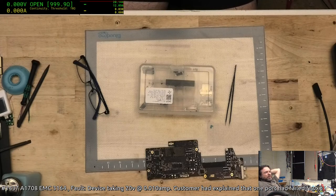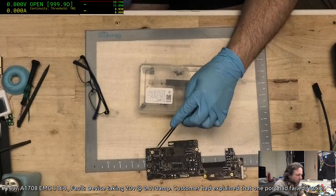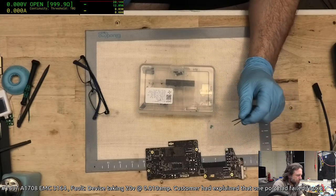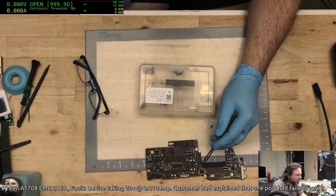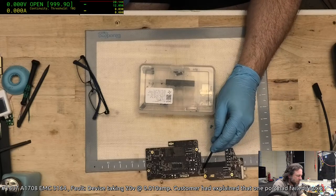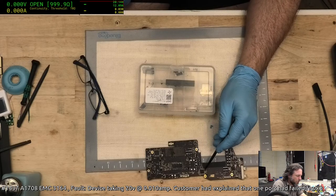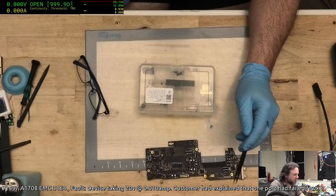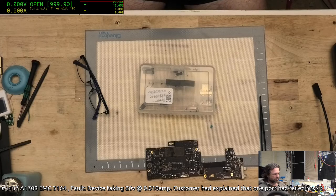Yeah, I've just got to think why we wouldn't be getting those elevated states. You know, SMC is a possible candidate, and it's a lesser complication to replace the SMC than it is to replace this banjo chip. I think it's a banjo, was it? Anyway, even though that chip is just a QFP, I would prefer to replace the SMC. These QFPs, the high density ones like that, they're a major pain in the backside to swap over.